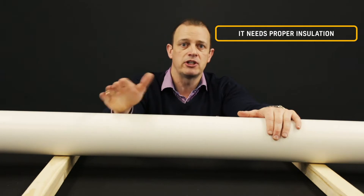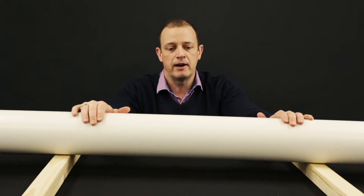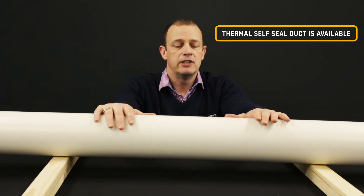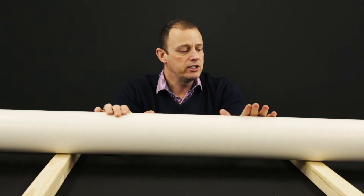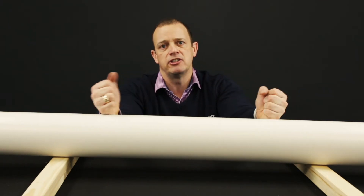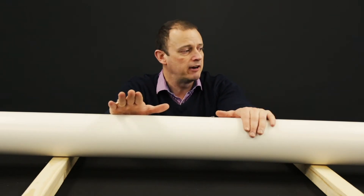We do a sleeve which goes over this — another video on that showing you how to put the sleeves on and talking through insulation. We also do what we call a thermal duct, a self-sealed ducting which clips together. It's already got the thermal properties for insulation and that's ideal. Or you can get insulated flexible ducting which can be used, but again we've got to be aware on the installation because it's flexible — it needs to be pulled taut and kept to a minimum. However, it is used in some scenarios.